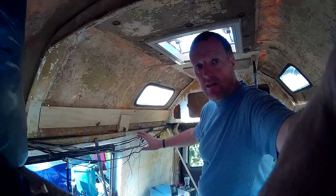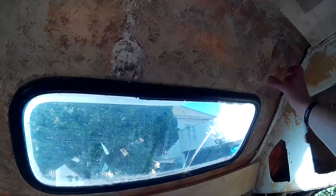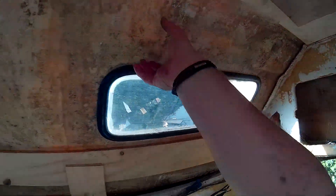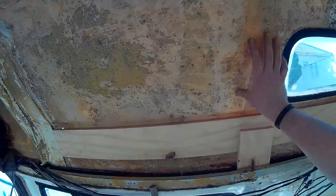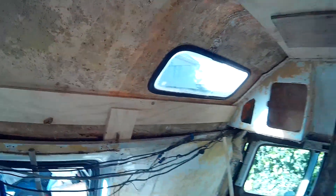I want to glue this one first, and then I can start putting my other pieces to it. My idea is to put a frame around a window — a piece in there, a piece along the top, one piece there and one piece there. Then I can fix my cupboards to that, and any gaps in between will be filled with insulation. It's only going to be half-inch thick, but as long as you've got insulation in there it should be fine — it's more than what was there before. If it's too cold I can always cut more battens and double the thickness and put in more insulation.